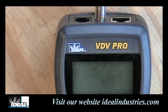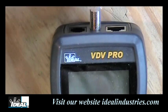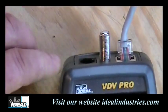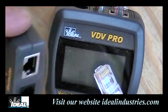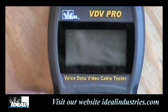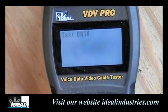If you're going to use a VDV to test data circuits, one of the things we might do is test a patch cable. So I'm going to take an RJ45 and plug it in the top of the tester here. And this is one end of a patch cord. And I've got the other end of this patch cord over here, and I'm going to plug that, the remote, in the bottom of it. Okay. And now I'm going to test this patch cord. And if I hit, again, any button will turn the tester on. It'll go right into the data testing mode.